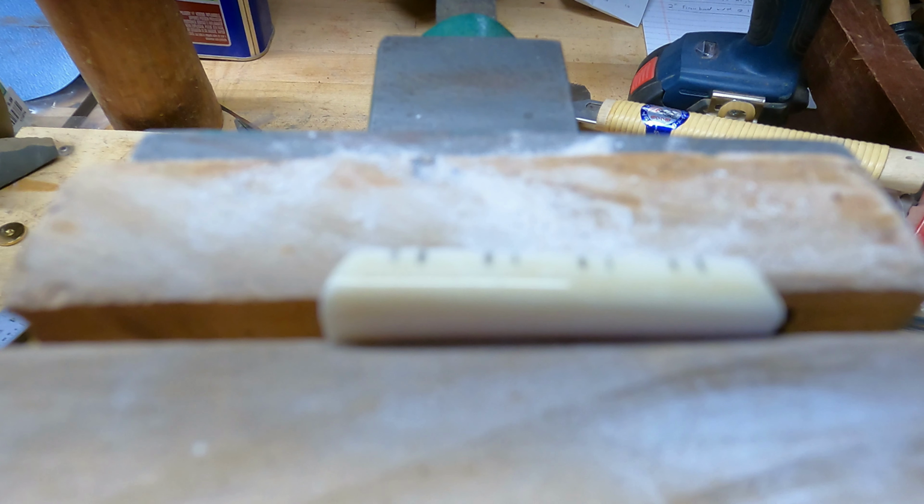We then glued on the top, and after that we pre-installed the electronics because of the lack of access once the assembly was done. We created inlays and set them into the Macassar ebony both in the head plate and the fingerboard. We made a dovetail joint. This is just a sliding dovetail joint for the neck and the body. Very simple joint. We then cut binding channels on front and back of the body and in the corners.